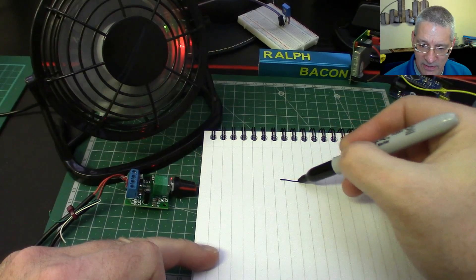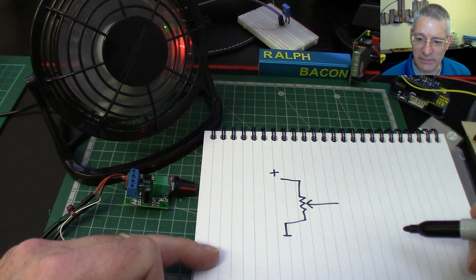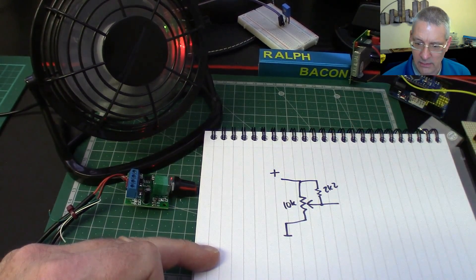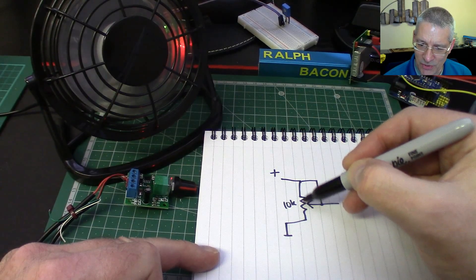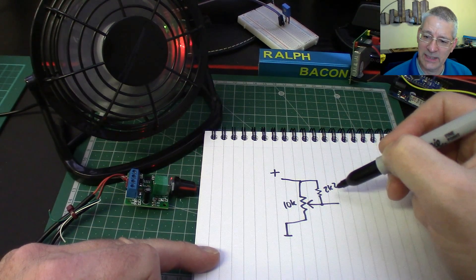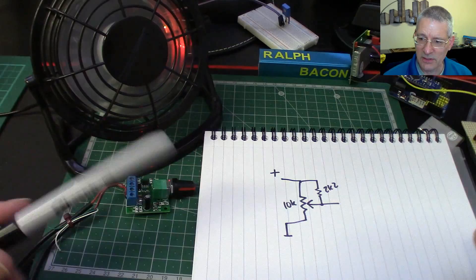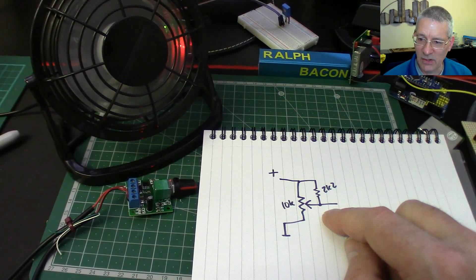If you've got the variable resistor — that's the hot end here, and that's potentially ground on the other end depending on how they designed this. What I've done is put my 2.2k resistor from the wiper to the hot end. This is a 10k pot, so the minimum resistance seen is going to be 2.2k, and it runs in parallel with whatever resistance you've got left depending on where the wiper is. It would look a little odd if you graphed it, but I've used this sort of hack for years for audio stuff.